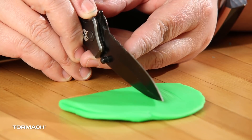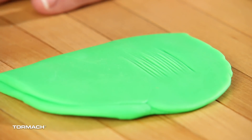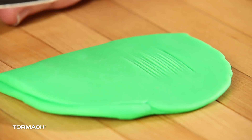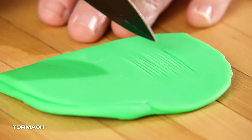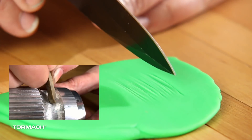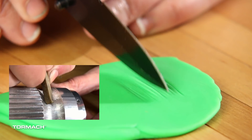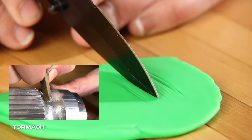I'm going to demonstrate standard hand polishing technique using this modeling compound and my knife. So typically when you start out polishing, you use a coarse stone first because you want to go as deep as your deepest mark. In the case of the part I was working on, I actually wanted to go as deep as the most superficial scratch. As you can see, we're going small, overlapping strokes, and we're only going as deep as the scratch that you want to eliminate.